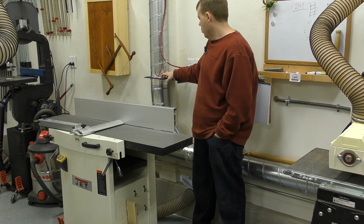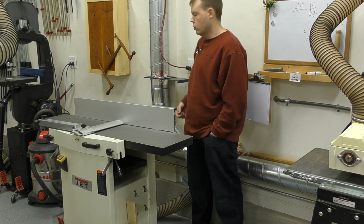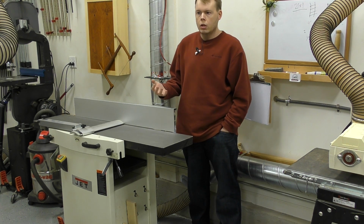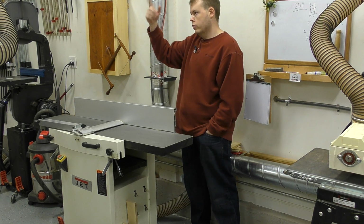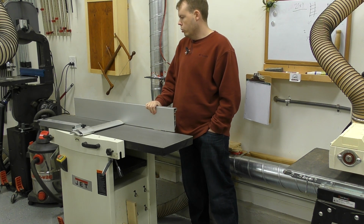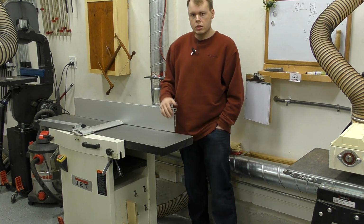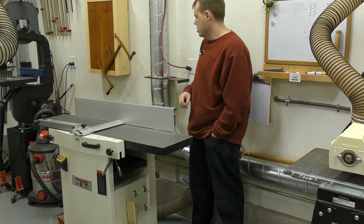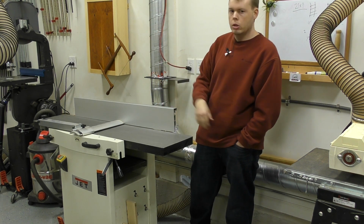And this is the one note over here on the dust collection. This is the main trunk that I have going over to the table saw in the center of the room. So I can keep open roughly 2 blast gates and still have adequate suction at the hose. So when I come over here and use this, I'll just shut this off and it'll cut off the 2 drops in the center. And then I have 2 gates open here all the time, with this joiner planer being one and my bandsaw being the second one. So all I got to do is just open and close this one blast gate instead of having to open and close each individual blast gate. That's a new feature that I've just implemented in the last week that's saved some time and it's really handy. So moving on down the line, let me show you the bandsaw.